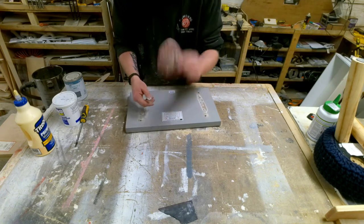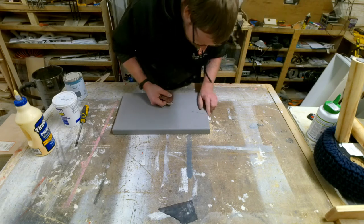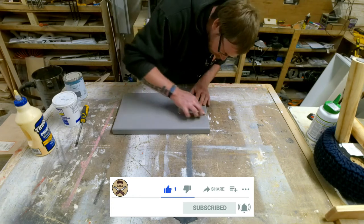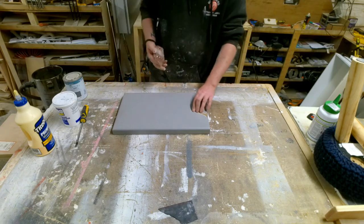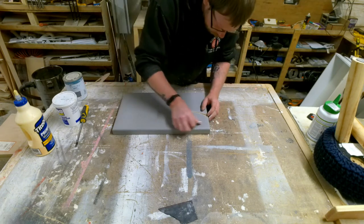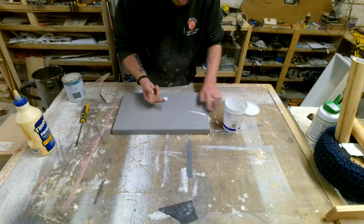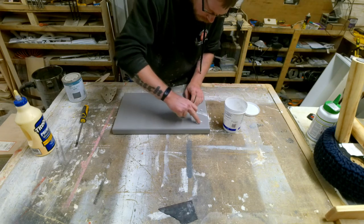We need to take this old glue off first. This is just a piece of 60 grit — I bought these by mistake thinking they had a removable triangle bit for the multi-tool but they're one solid thing, so I'll just hand sand. I'm going to knock this down a little bit just where this gouge is — it looks like something's knocked against it. Because it's MDF it's really easy to work down. I'm going to get some filler in there — all purpose ready mixed interior and exterior filler. Just brush it in with your finger so it leaves a smooth surface and gets into that crack.